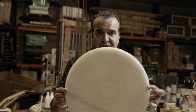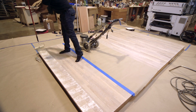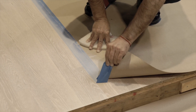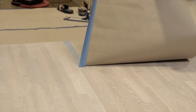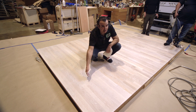This time, instead of carpet, I'm going to use a white pad — this way I can leave a little bit more extra white oil because the customer wanted it whiter than the first finish. I'm going to wipe the perimeter with a rag, take the excess off, and hit it with the white pad because I'm finishing everything with the white pad, so the spread rate should match. After applying the extra white oil, I'm going to remove the tape, make sure the connection is clean, and then dry it. Now you can see the difference between one coat of color oil and two coats. If I want even more white, I can go a third time.